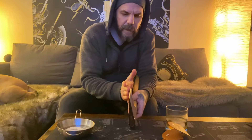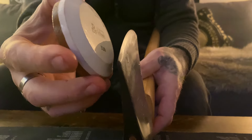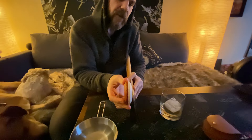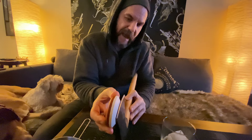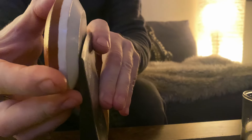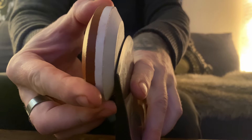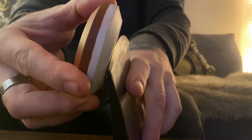You're looking for the plane on the bevel of your axe, just like in our knife sharpening video, only this is going to be a lot more straightforward. You want to line up your puck. When you place the puck against the axe, you can see that little spacer between the puck and the blade edge — noticing that little gap, a black line, almost like a marker line in between. You want to close that angle to the bevel so you can't see that marker line anymore.